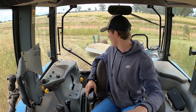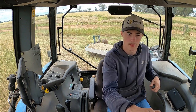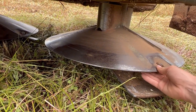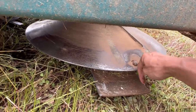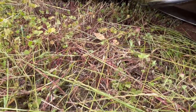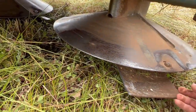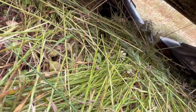I'm just going to hop out and have a look at the blades on the right side drum — it didn't seem to be cutting very well down that last parcel. Whether I'm missing a blade or it needs sharpening, I'll go have a look. There's a problem — that blade is supposed to be sticking out, like that one there, but it's been knocked and hit under. And the next one is the same.